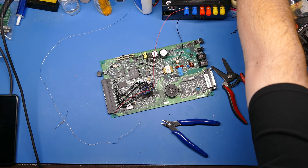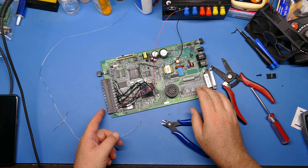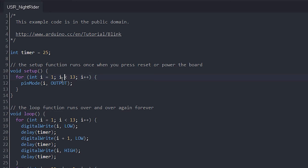Fingers crossed. The Arduino is getting power, but the LEDs are not lighting. Going back to look at the code — I did do something wrong. In my for loop, I had the comparison symbol wrong: I had a greater-than instead of a less-than symbol. So my program was never actually running because that condition was never met. Now I've got that corrected in all of my for loops and things seem to be working.